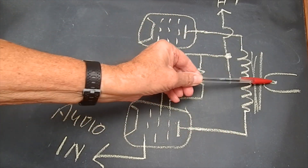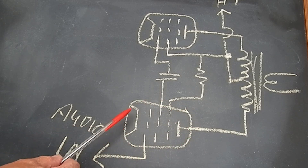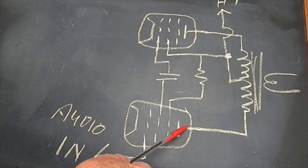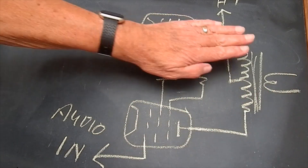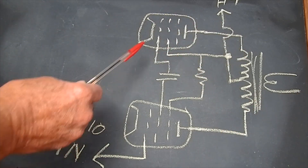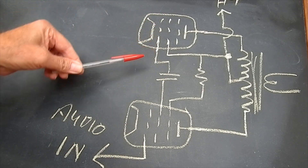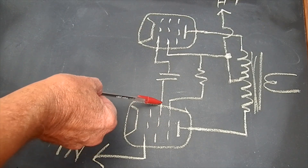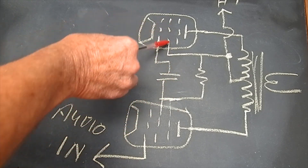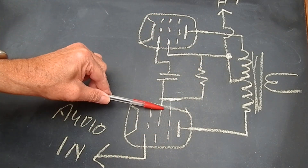This is the output transformer — you've got HT to the middle, then that half goes to that valve and that half to that valve, and that is the loudspeaker there. Now this gets a little bit complicated. Take this valve here — control grid, audio in here. I haven't drawn all the other components, it'll be confusing. Audio into this control grid, out of the anode — normal output transformer type arrangement. So just forget that half: there's a single-ended audio output stage, control grid audio in, output transformer, speaker. Now this half — this control grid here — this is the push-pull arrangement. There's the control grid; it wants audio put in there. So it's taken from this screen grid — you can get audio out of there.